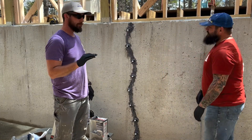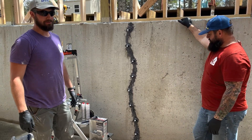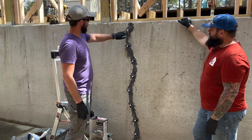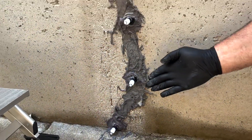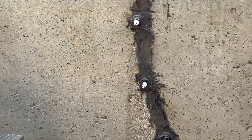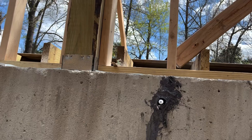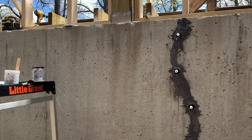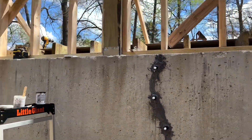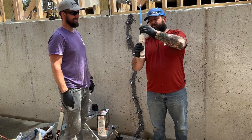We now have two coats on there. We came back with another batch we mixed together because the first one went hard so quickly. We put a little extra coating over each one of the ports to help hold them on better. It's not the most beautiful work of art, but if we were to do this again with exposed walls, we'd mix up smaller batches. Luckily this will all be covered up. Our main goal is just making sure none of the resin we're injecting next squirts out.